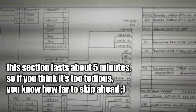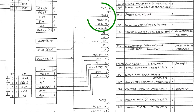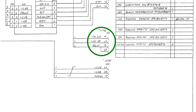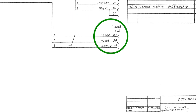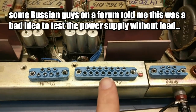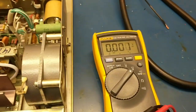I've got this schematic up on my laptop right now. We've got a big connector in the middle with 15 pins. You can see 5A, 6A, 7A, 8A are all supposed to have 5 volts, and then 3B through 7B is ground, with various signals on that side. Down here you've got some plus 5, plus 12, and ground for the floppy disk controller, and your input power supply at 220 volts. So we've got floppy disk power, the big 15-pin connector, and the 220-volt line. Let's take some readings through all this.